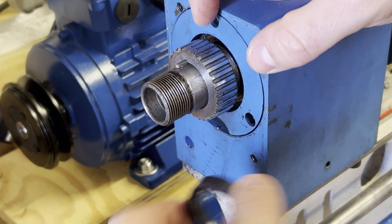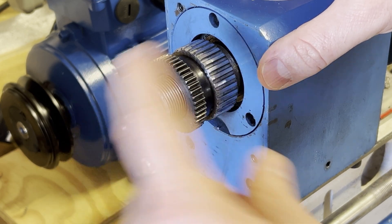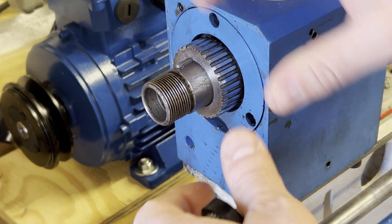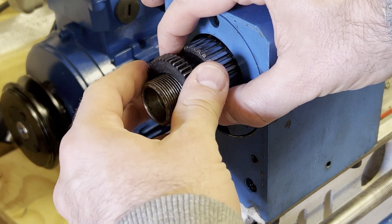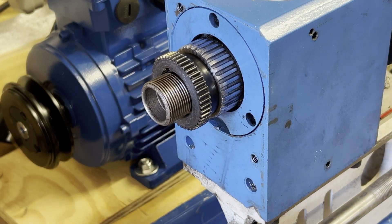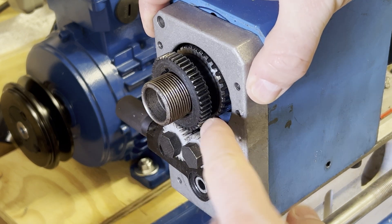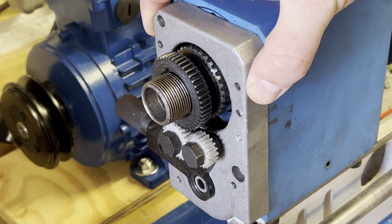When it was three mil sticking out, you'd put this on and the keyways disappeared — that was no good. By taking the three mil off, this seats back properly. I can put the original spacer in and there's enough keyway now to hold this in place. So now it doesn't spin, and also allows the gear to sit in line — whereas before with the new bearings that wasn't in the right place.